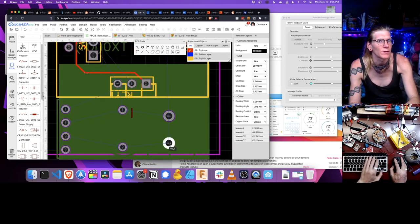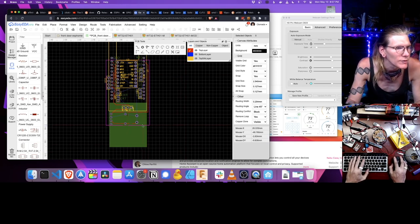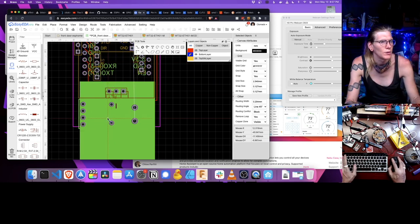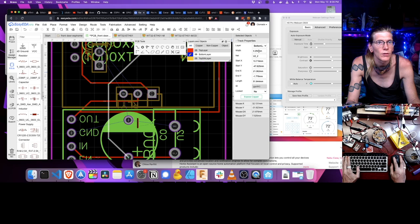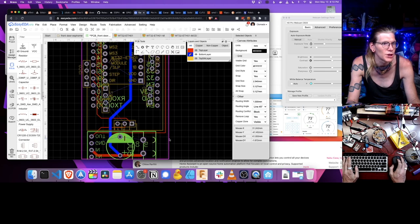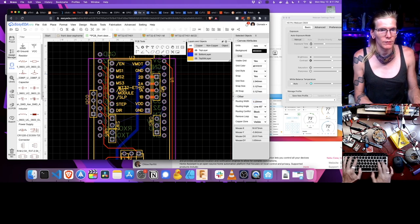I'm gonna thicken these. Put VMOT all the way up there. Do signal wires. Will just work way better. I'm okay with just shoving a power wire down the center. Should be on bottom. Let's put you on bottom layer. Sick. Dealing with it, width is 1 millimeter. Chonky power wire. 1 millimeter. Beautiful. Nice big, chonky power. All right. Top layer order. Yeah, 1 millimeter. Nice chunky output. All right, 0.254. Drop that back.